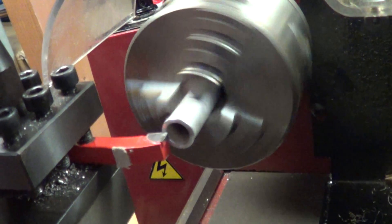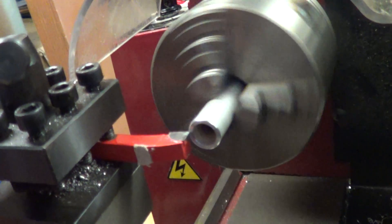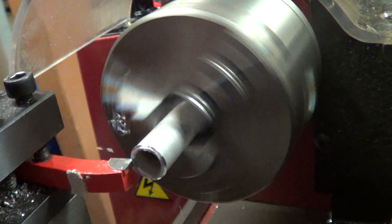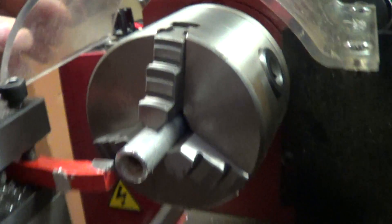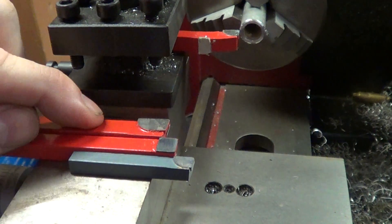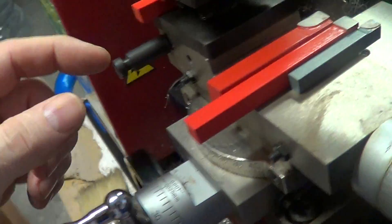If the tool is at the right height it's going to cut a little bit better. That's just so the tool is at the right height in line vertically. Again, that's the three different bits: 3/8, 5/16, and a quarter — and this machine is set up for 5/16.